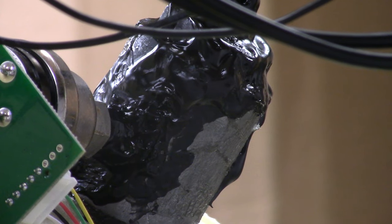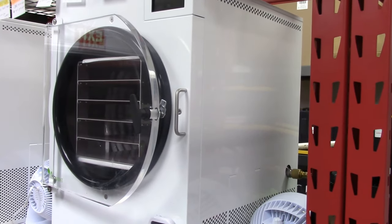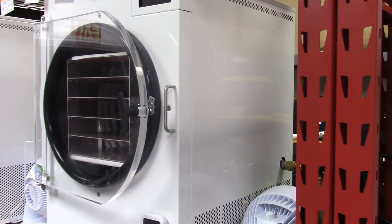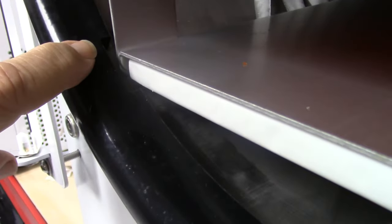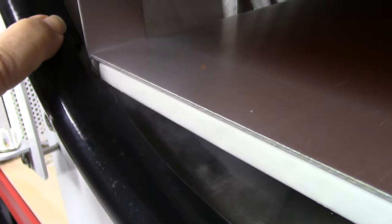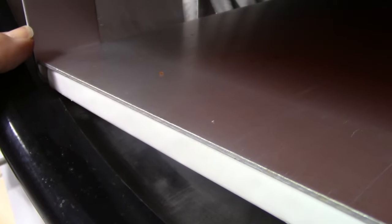Normally after we do this, we don't have a problem with our vacuum. This machine — I couldn't get it under 1300 mTorr. Now it goes down to about 178 to 180 mTorr. It's a phenomenal machine. This is the new style which has got all the circuitry on a tray that you can actually take out, which is pretty cool. Here's a shot of where we actually cut out the rubber — right there. The seal will actually go back about maybe a quarter of an inch because the vacuum pushes the seal back. And if this seal is hitting against the tray, it's not going to want to seal all the way.